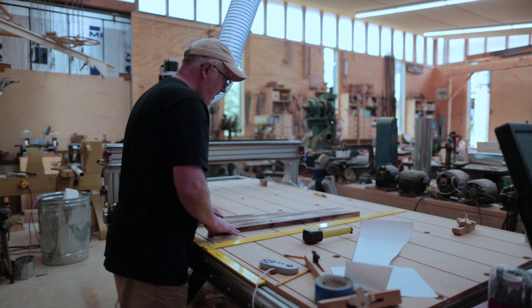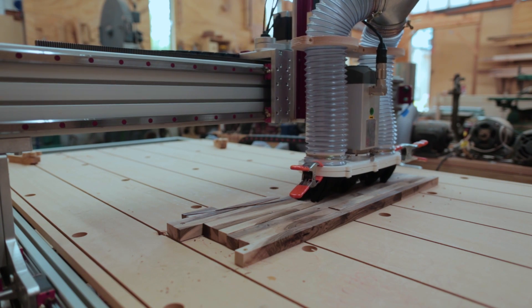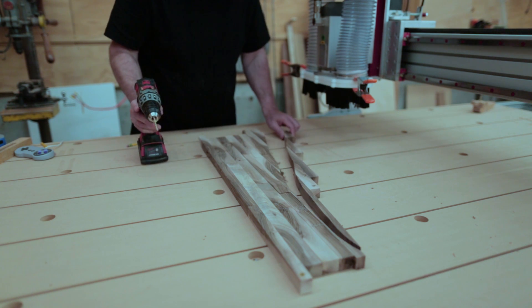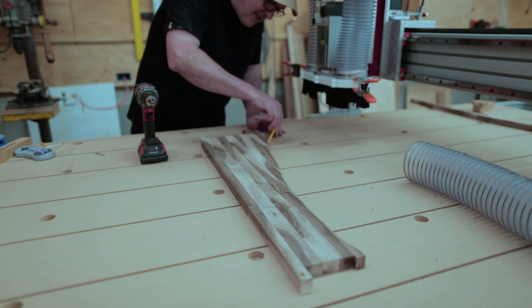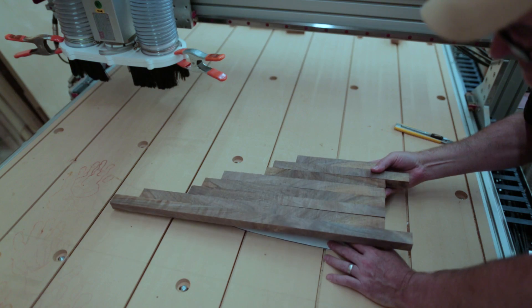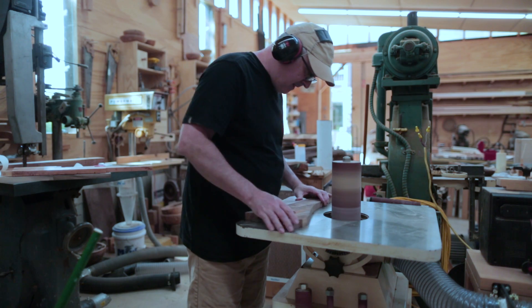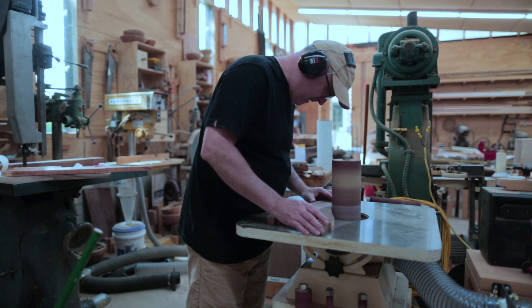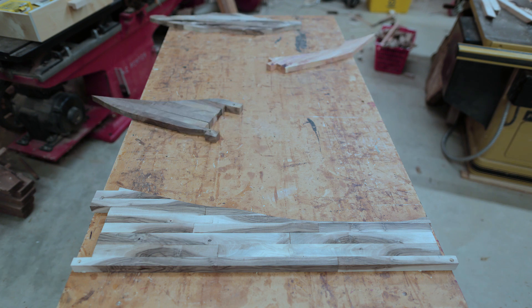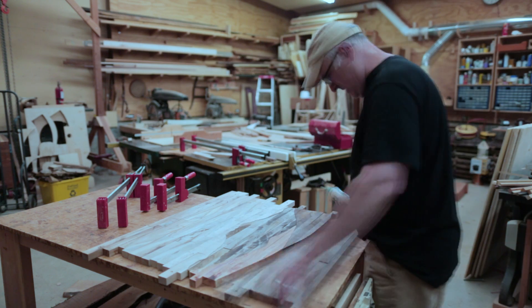All these pieces I've been gluing up now have to be cut so they'll fit together. I did this by setting a single zero-zero point, then cutting each piece relative to that same zero-zero point so they would all fall in the correct location in the final piece. I cut the first piece, then traced the outline to tell me where to put the second piece on the table. Now this is the sky getting cut. All the pieces can go together — just five pieces of wood, but you can kind of see the photograph in it. Then one big easy glue-up to put it all together.